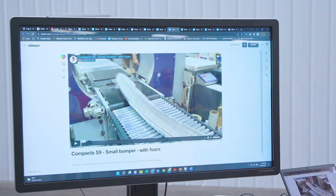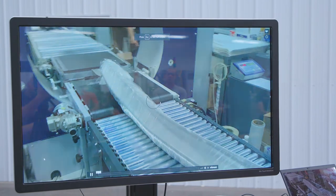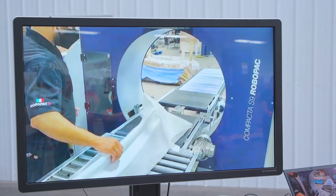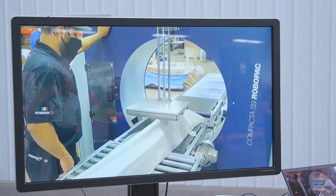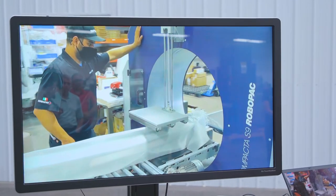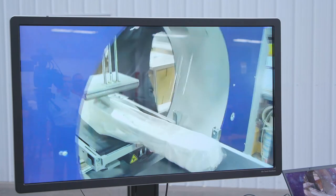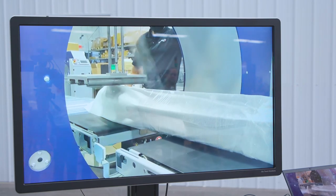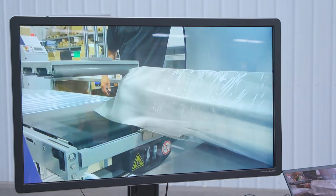I'm going to bring this up — this is something that would not wrap well. I get asked a lot of times about automotive bumpers; they're still doing it by hand with the big chrome midsize heavy truck bumpers. Not everything is good through a horizontal orbital because of the convex shape — if it has a really big arc to it, all that material wants to slide to the middle. So sometimes take a picture if you're questioning whether a product is suitable.